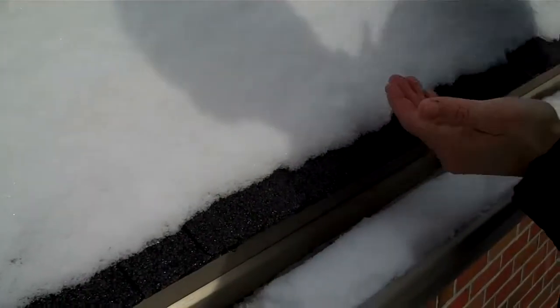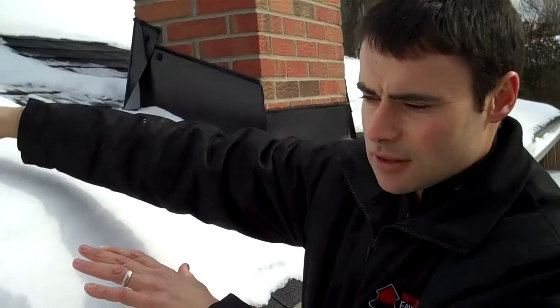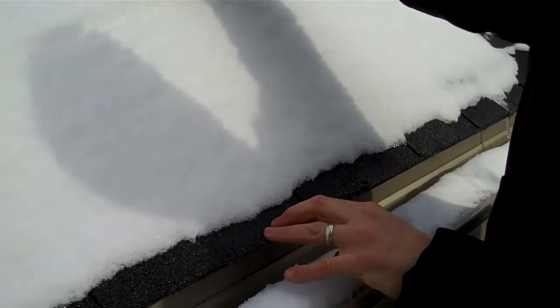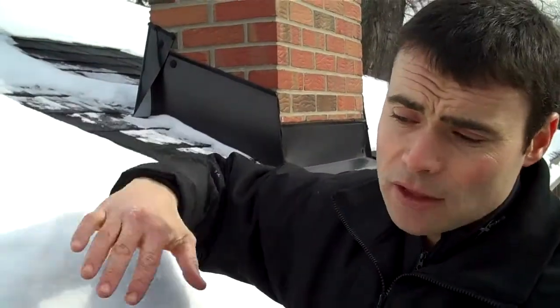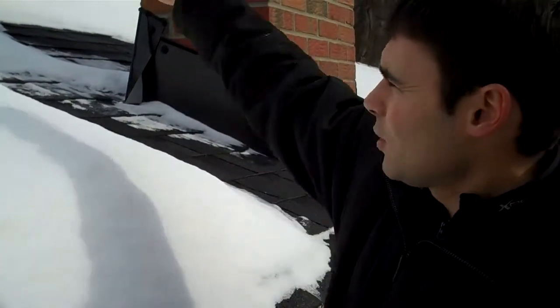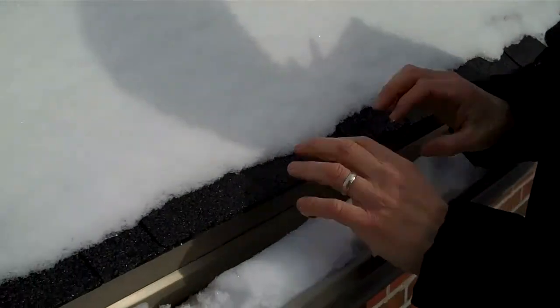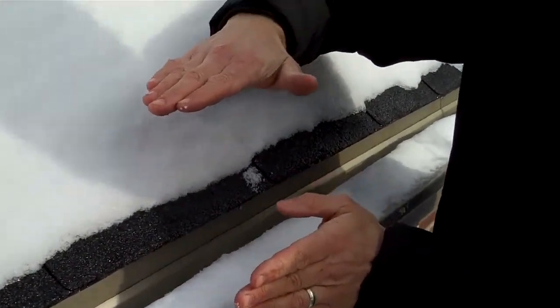If there was a heat loss problem through the attic, then what happens is this bank of snow starts melting from the underneath. As it melts from underneath and slowly decreases in size, the water starts dripping out from underneath this layer of snow. What the snow does is it actually creates a good layer of insulation on top of your roof to hold any heat inside your attic that could be escaping. So slowly this whole bank of snow starts melting, it dribbles down the roof, and that's what starts to create this big four or five inch block of ice that you see on some people's homes.